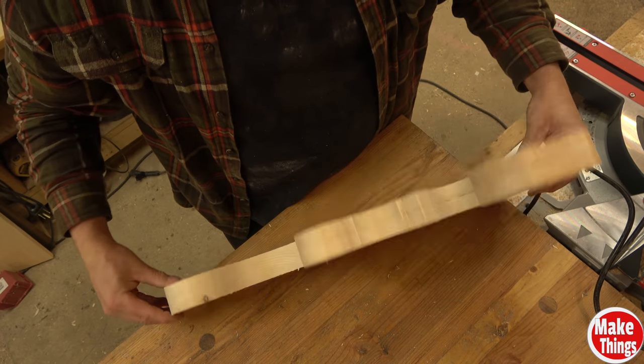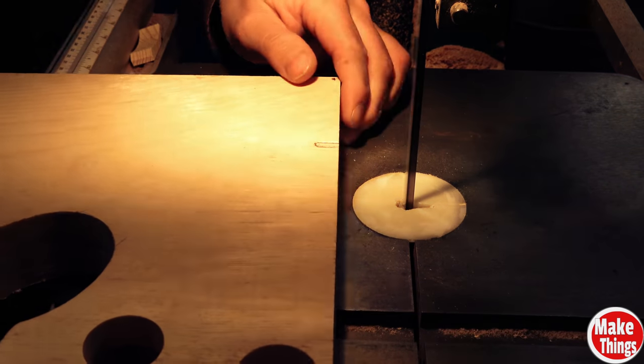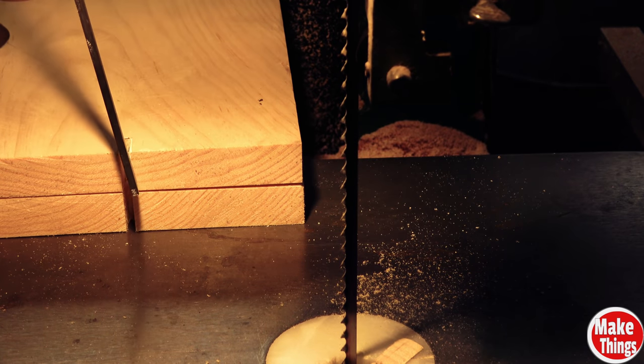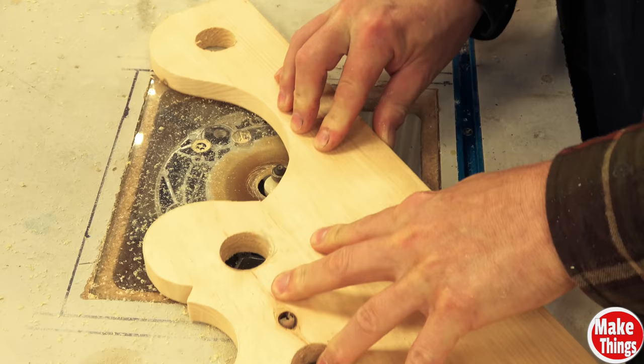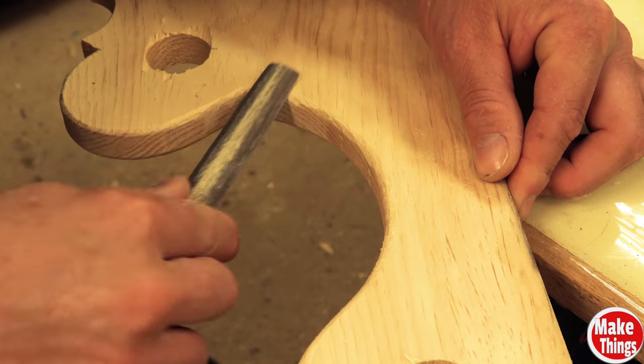And here's the final look. I'm going to add a little notch at the bottom of my board for an eighth inch steel bar to fit in — something I'll explain more a little bit later. I hit the router to give it a slight round over. Again, you don't need a router to do this — a file will do this just as well, or you can leave it alone.